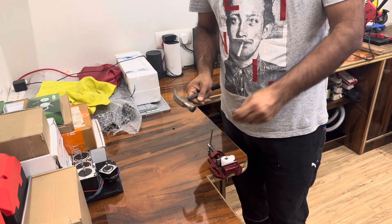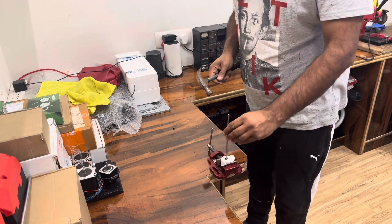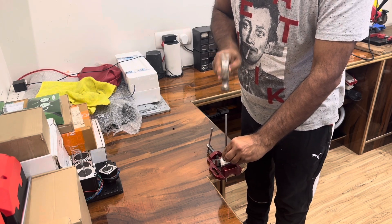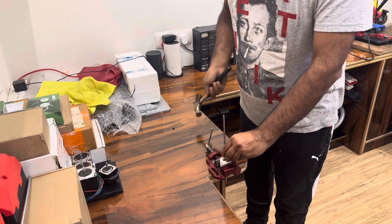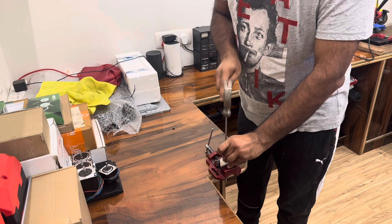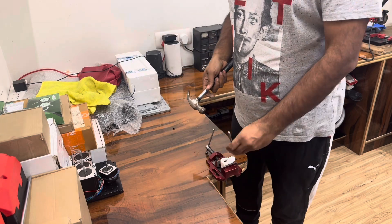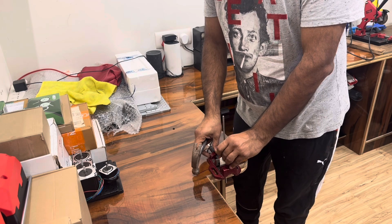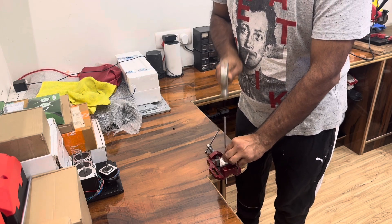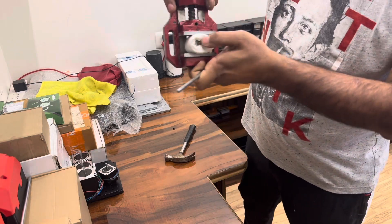This is a 5mm shaft, so use another longer 5mm diameter shaft. Place it on top of the existing shaft — given that the core is magnetized, it will most likely stand on its own. Lightly push the original shaft out. There will be initial friction while the adhesive bond breaks, but once it breaks it should be easy to push out. The same-diameter replacement shaft supports the hole as the original is pushed out.